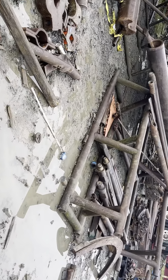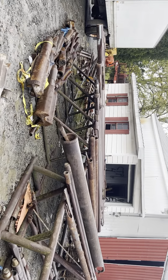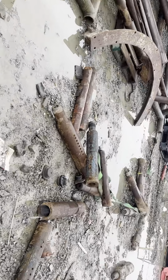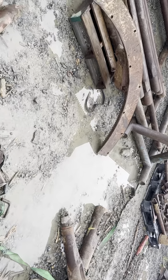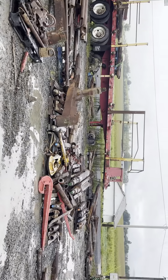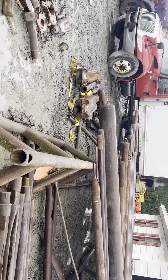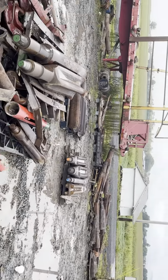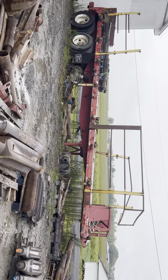Thread protector — find something it fits on. Wood pieces need picked up. The grease inside these thread protectors — there's quite a bit laying around yet. Find something they fit on, grease them, and screw them on. That's for stuff outdoors, either in that row or that row, or on here or on the ground. Really, the stuff on the ground is probably top priority for getting thread protectors, because it dips down into the dirt and that makes the rust extra bad.